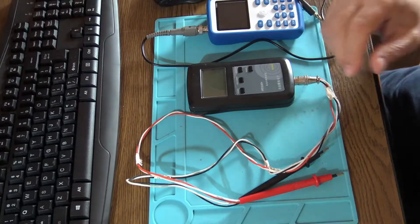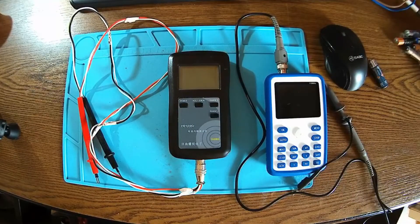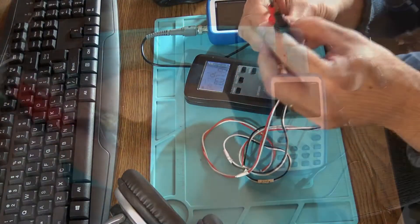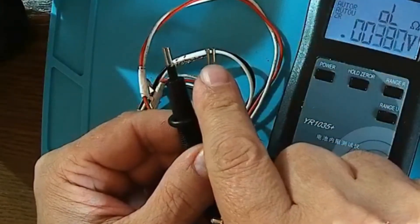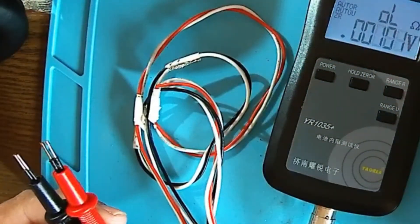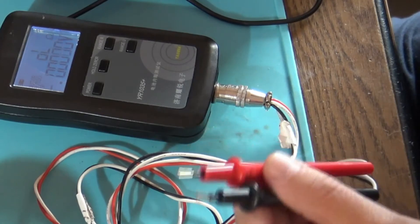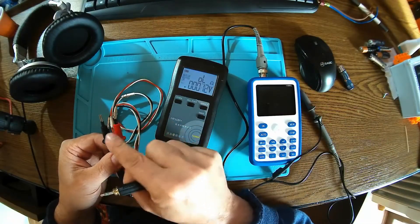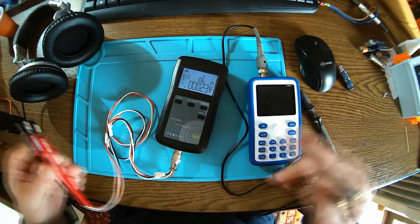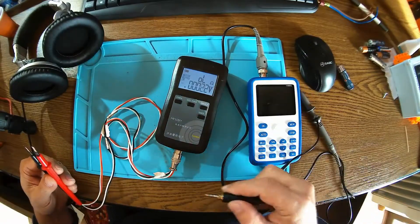When I'm measuring a loudspeaker or headphones, I can clearly hear a sound. The measurements here are done with four wires. For low resistance, it compares voltage and current — one pin sends voltage, the other sends current, and there's a mathematical way to find resistance from the difference between voltage and current.